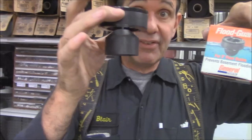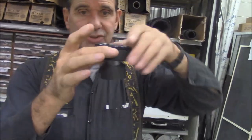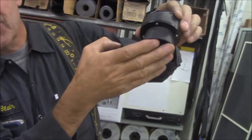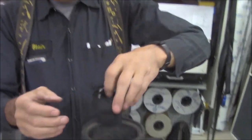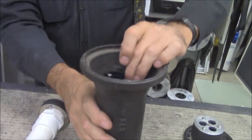In front of the floor drain in front of the laundry tubs, oftentimes we can put in a flood guard check valve. This is built by the same manufacturer as the standpipe adapter. The only difference is it's got a check valve on it — when the water comes up, boop, it shuts off. So I can put this in front of my laundry tub, install it just like the standpipe, get it sealed in there. Now if anything goes wrong in my house it can drain out, but if there's a flood coming, the flood can come up, shut the water off, and no water will come out of that floor drain.